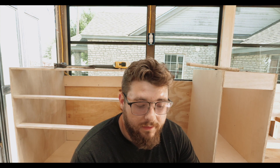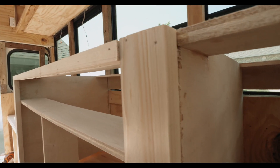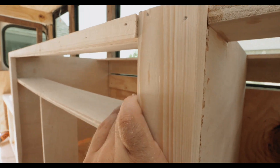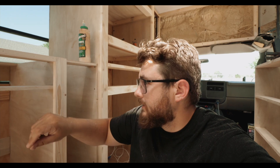Alright, so here's a pro tip for people who are somewhat new to the woodworking kind of thing. I'm still an amateur myself, but this is something I found very useful and it's overlooked - it's thought of as old technology and people don't want to use it. I have a block plane for things like this. I had to scab two pieces of wood to make it stick out the right dimensions I needed, so there's about a quarter of an inch sticking off - and that would be a lot of wood to sand. I like old hand tools and they work very well for the application they were intended for, so I'm gonna show you how I trim that up to be flush.